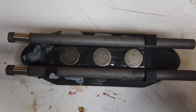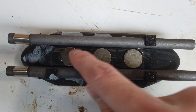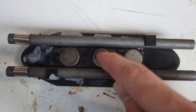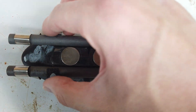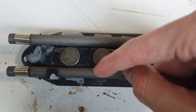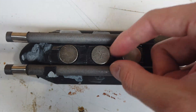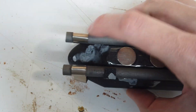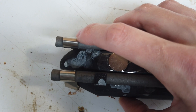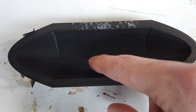It really is super simple. I've just sticky taped some magnets all in the same orientation — so either all north or all south facing, I can't actually tell. And then there are these two graphite rods that sit on either side of them. Current will pass through our conductive solution in between them, and the whole Lorentz force thing will happen on top of these magnets. I've got some titanium connections over here that just clamp onto the graphite rods so that we can sit a battery pack in here and make connections to our graphite.